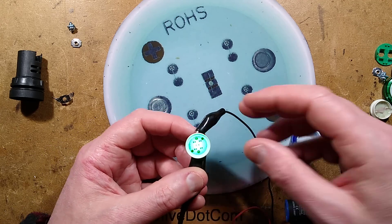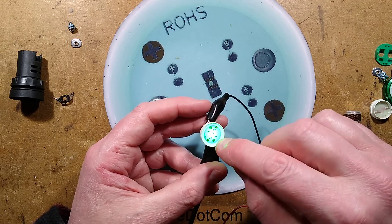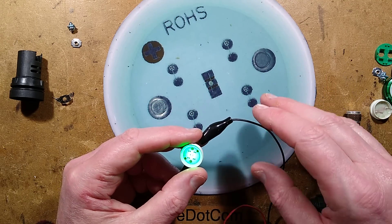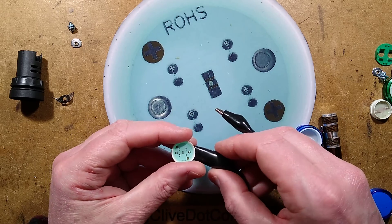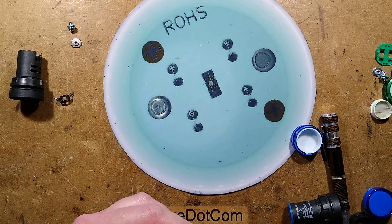I can show you the green module with its single chip doing all the work. The blue one they pushed to 20 milliamps, which is kind of pushing the limits of the little standard chip in there — not what I'd call reliable. I prefer my LEDs to be used in bulk and underrun for reliability.